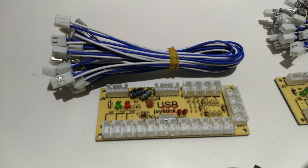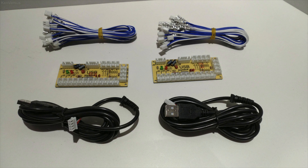If your Pandora's box doesn't have a 40-pin header, you can always use USB encoders. There are many to choose from, but the zero-delay ones I've used for most of my projects. The joystick and push buttons connect to the USB encoder, and then it plugs into the Raspberry Pi's USB ports. They act just like a USB gamepad and will interface between the Raspberry Pi and the arcade controls.